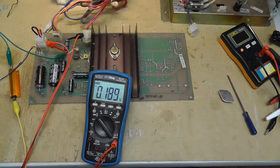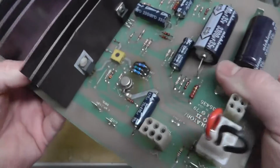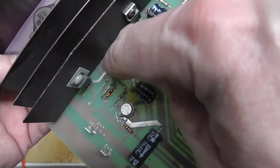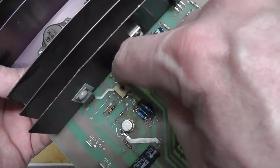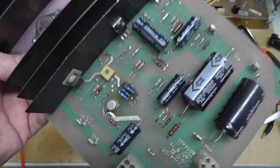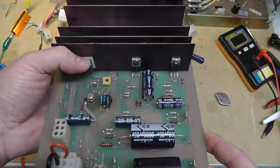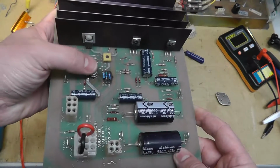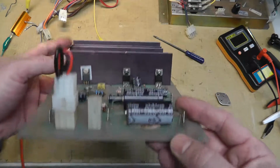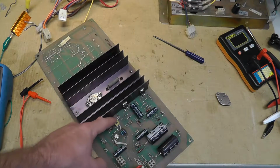Let me make sure all my connections are wired up. Okay, right. A little further inspection, and I see CR4. It was like that. I went to desolder it, and it basically just fell in half. So that could be our problem, CR4 there. Let me replace that. I'm pretty sure I tested TIP32 good. This should be good. Could be the voltage regulator not turning it on in the circuit, I guess, but it sounds like it went into this. CR4 is probably the problem.